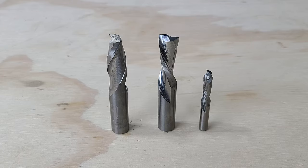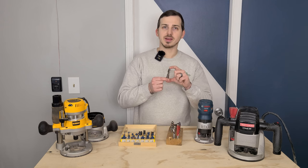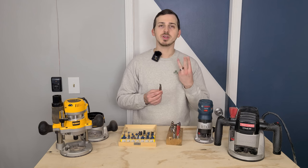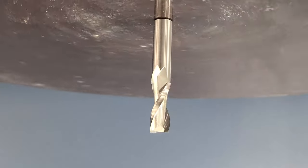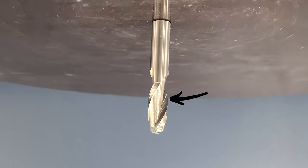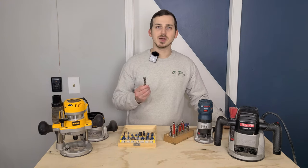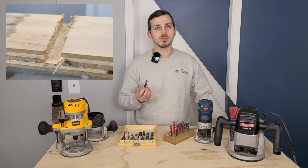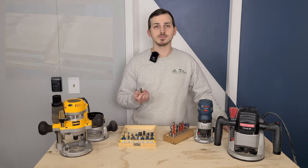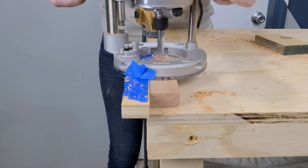These are spiral bits, also called mortise bits. Instead of having a straight blade, the blade wraps around the body of the bit, meaning only one point is shearing at a time — so you get a lot less chatter and kickback than with a straight bit. Spiral bits come in three varieties defined by the angle of their flutes. Upcut bits have flutes that spiral up as the blade cuts, pulling chips up and out of the groove — similar to drill bits. This means an upcut spiral bit can cut faster and run cooler, making it ideal for plunge cuts in hardwoods, though you're more likely to get tearout on the top edge.